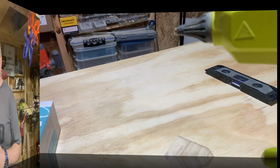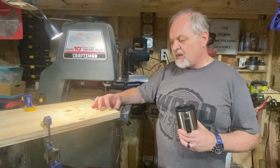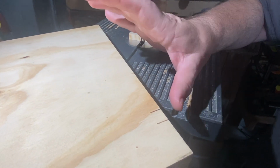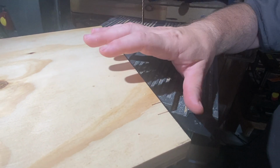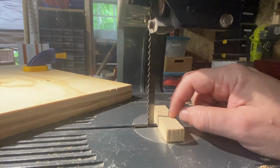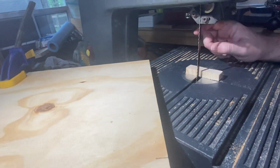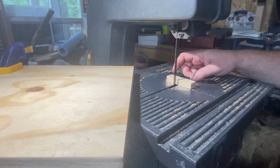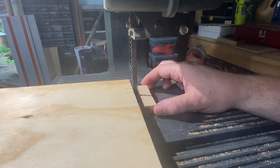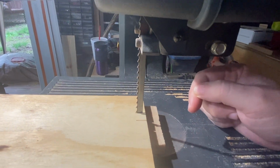The dripper. So for this project, because we needed a very small distance depth here on our cuts, and we needed a lot of them, we did 2 things. First of all, we cut 1, and then we use that as a template to cut the rest of them. And for the depth, we simply set a stop. A little bit of wood glue, which is the friend of every carpenter, and a stop, so we didn't have to calculate every time how deep to go. As you see, it stops it in the correct distance, and we don't have to calculate it every time.